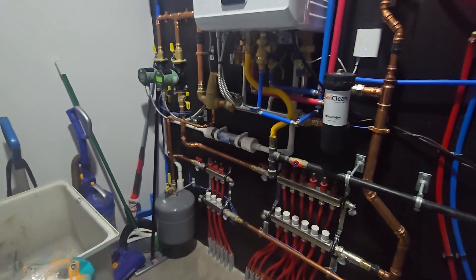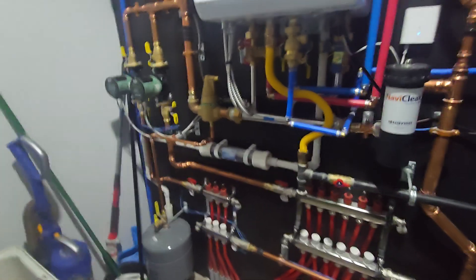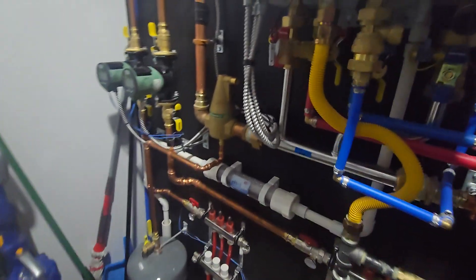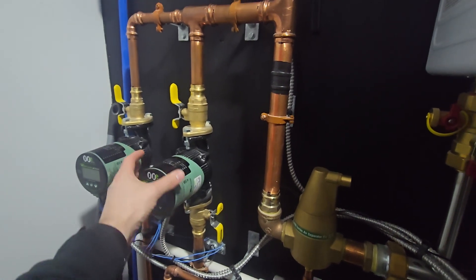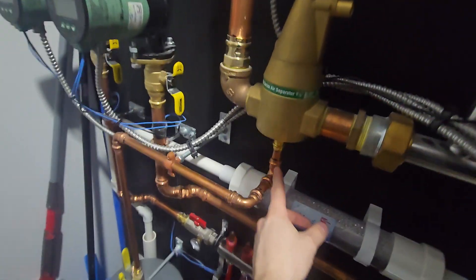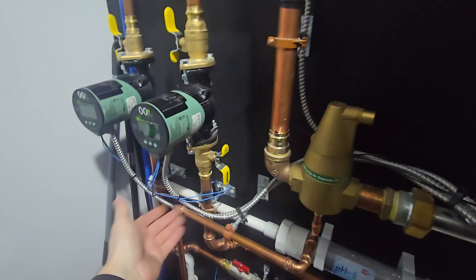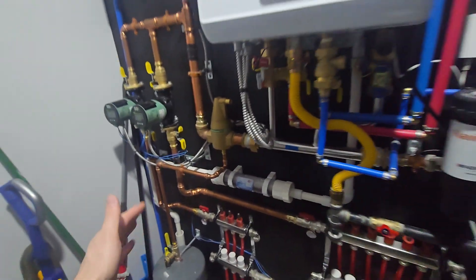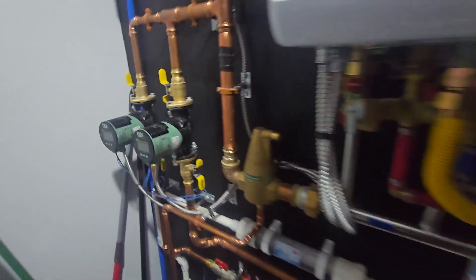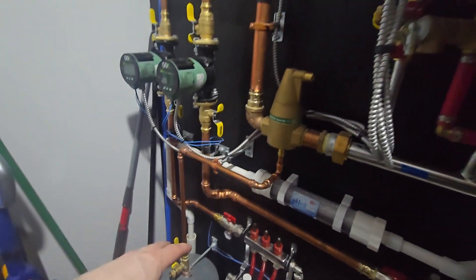To go over quickly where you would place the expansion tank in a system — ideally it's going to be at the point of the lowest possible pressure, which would essentially be before the secondary circulator pump. On this system, here's one of the secondary zone pumps, and if you follow it up, it's pulling right from the air separator — and right off that air separator is our piping to our expansion tank. The point of lowest pressure is going to be before the pump, and the point of highest pressure is going to be right after the pump. The pump is pushing at its highest pressure at that point, and when it goes through everything, there's a pressure drop all the way back, where the pump is now pulling the water as opposed to pushing.